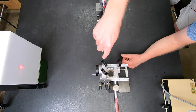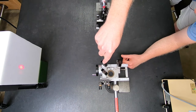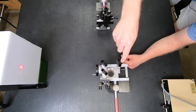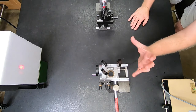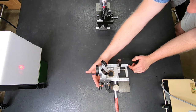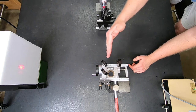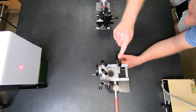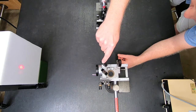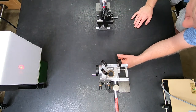So that's one path — from the beam splitter back that way. The other path is to go through the glass, hit the surface, go back through the glass again, hit this mirror, which I can't tip and tilt, but I can move it back and forth with a fine adjustment and a coarse adjustment. That sets the difference in path length. That light then bounces back through the glass a third time and gets split again — half to the screen, half back to the laser, and we ignore it.